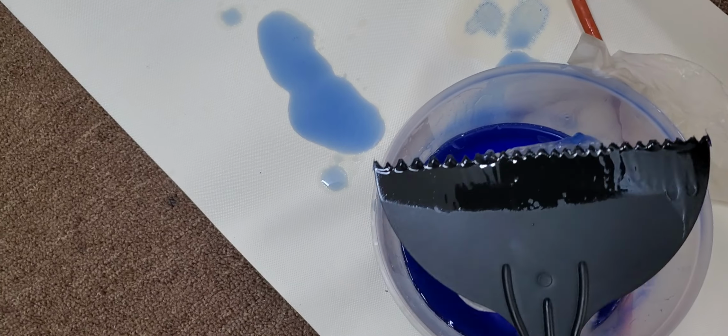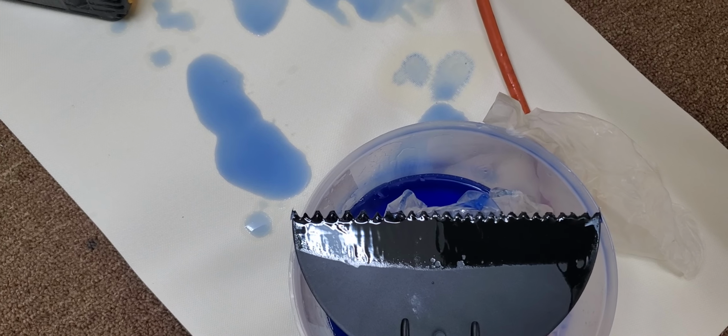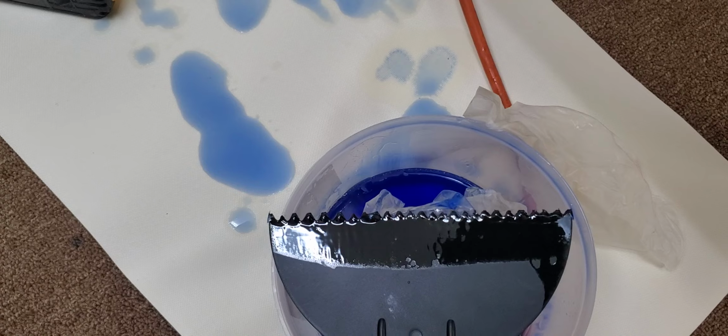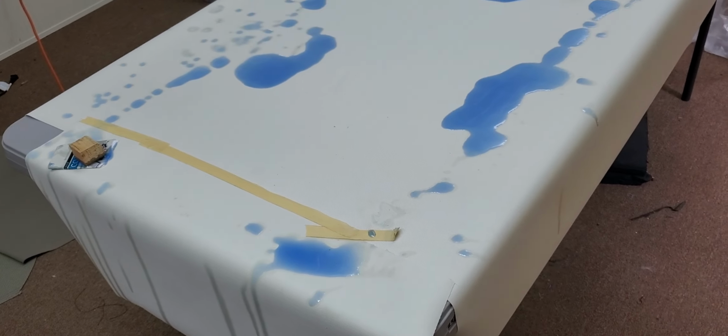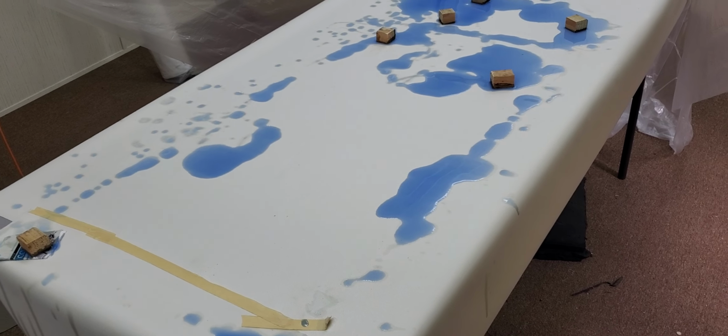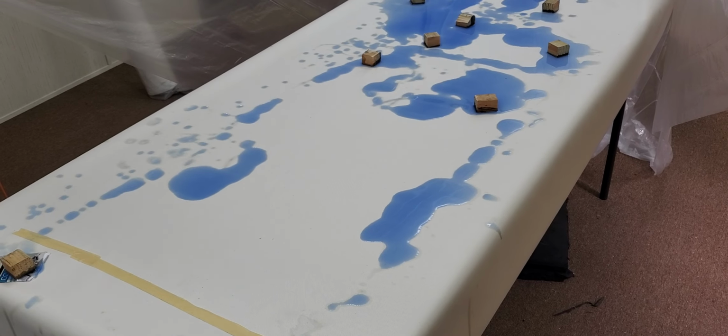And also, if I can get it loose, I made this out of a regular spatula. You can buy those with the grooves, but I didn't have one, so I just took a file and cut those grooves in it. That made a huge difference because it just distributed the epoxy nice and even, and then it filled in.